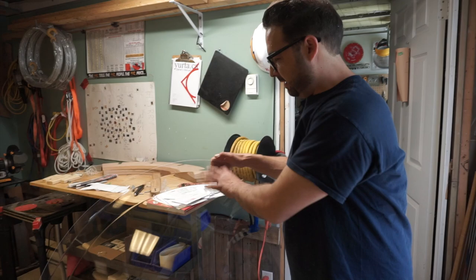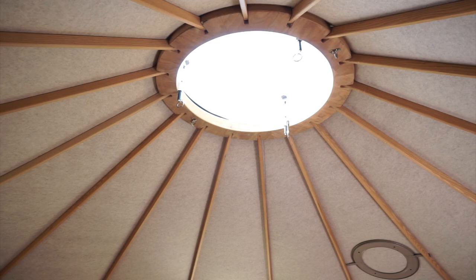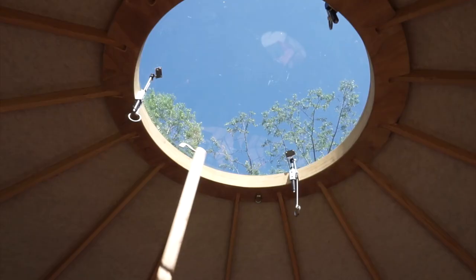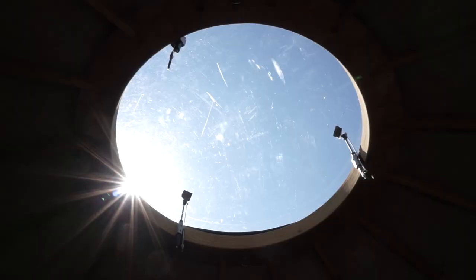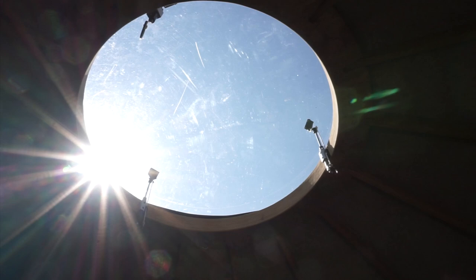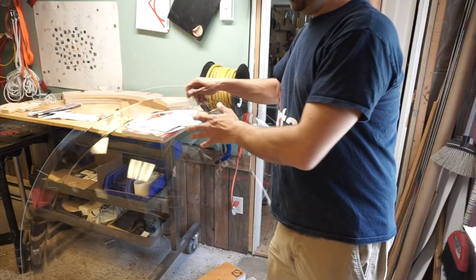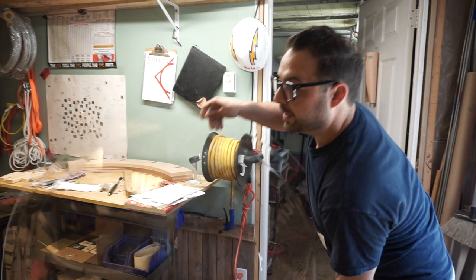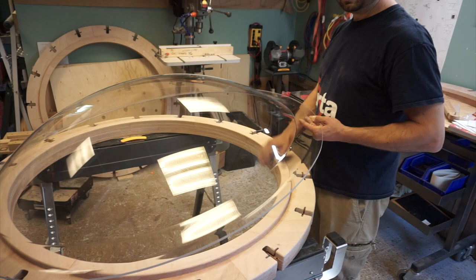And there's our ring. This is a four-foot clear dome that goes on a yurt, and this is an operable dome. This dome can be raised and lowered by the user and it's the primary way you're venting your yurt. A functional dome is really important because you're convecting heat like a chimney all the time, escaping out of the yurt. We mount this to a finished ring so that the dome can raise and lower and allow hot air to escape.